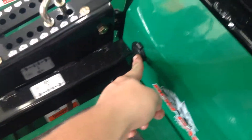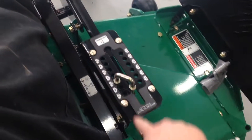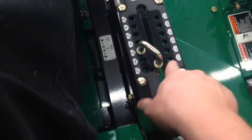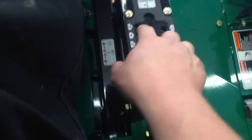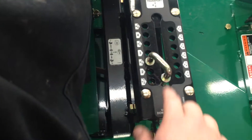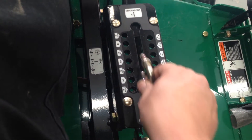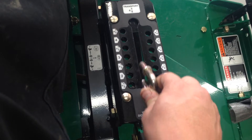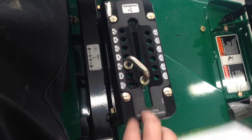You've even got a cool little 12 volt accessory plug. Now, if you come over here and you actually sit on the unit, this is what you would use to raise and lower your deck along with this. As you can see, this has a bunch of different notches — it goes from an inch and a half as its lowest point to four and a half as its highest point. Most people cut at two and a half. You'd basically just take this pin when the deck is in the upright position, select which height you want to cut at, and drop it in.